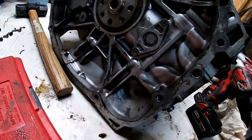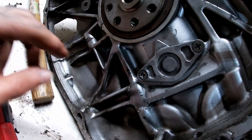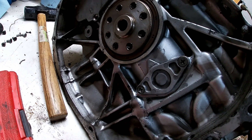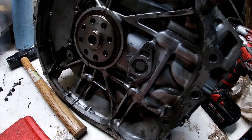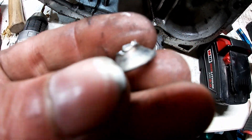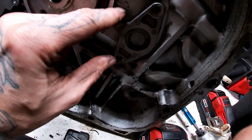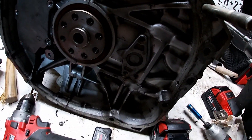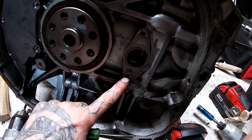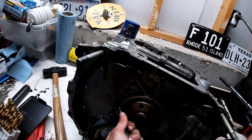So that's what I was kind of afraid of — these Phillips head screws can be really bad sometimes. This one seems to have stripped pretty bad, so I'm going to get my drill and try to drill that out. Not really sure what else I could do, maybe get a chisel or something. That was pretty quick and easy actually — success, just drilled the head right off of it. Hopefully we can get that out of that hole pretty easily. Might have to get a reverse drill bit and drill in there just a little bit to hopefully back that screw out.